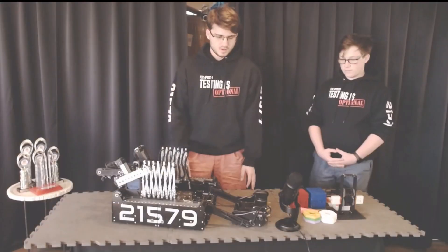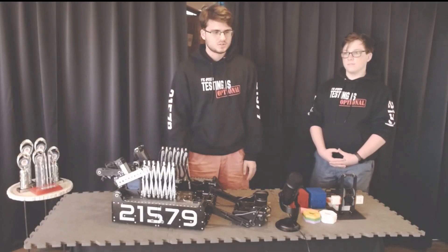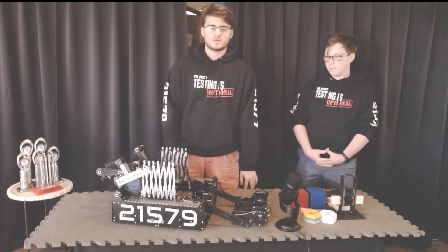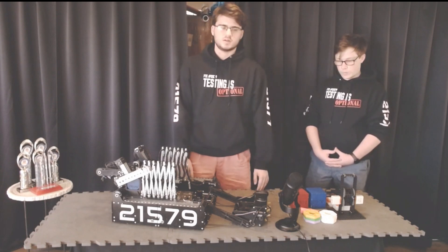You're using two servos in continuous mode to power the whole intake. With most teams this season it's been about using the fastest motor possible, so were the servos the first thing you tried, or did they come about because of motor weight or packaging? We wanted to go with servos from the start because we wanted the whole intake on the virtual four-bar, so we needed it as light as possible. We first tried GoBilda servos but the intake jammed a lot due to low torque, so we switched to Axon Minis, which helped a lot.